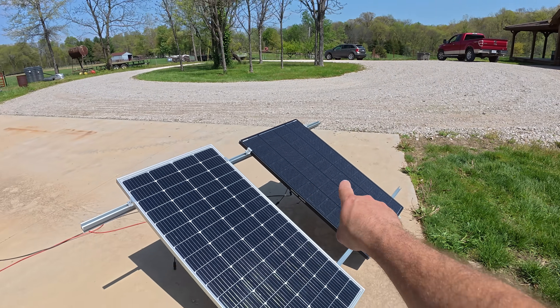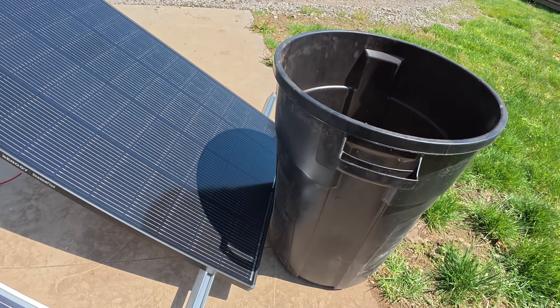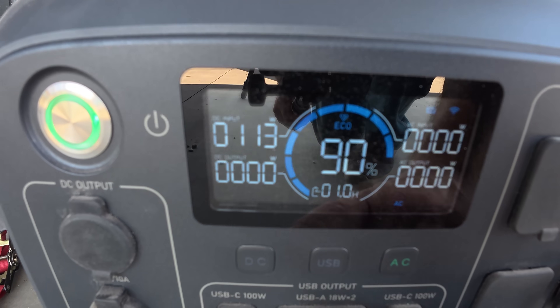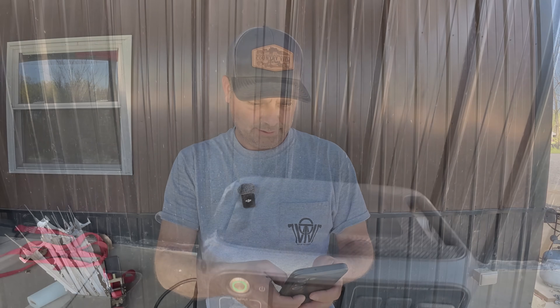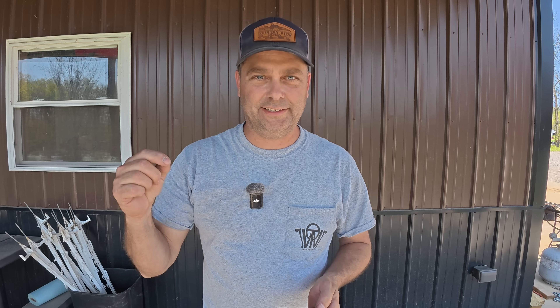The Shadow Flux panel is back at 169 watts in full sun. With the trash can shade covering the same bottom three rows, it's reading 113 watts. That's 113 divided by 169 — still 66% of its original output, compared to 14% for the standard panel. That's a huge difference. You can see shading has a massive effect on standard solar panels, sometimes dropping them to near zero, while the Shadow Flux still delivers two-thirds of its output.